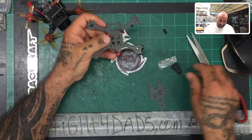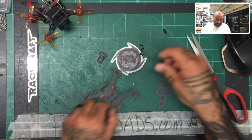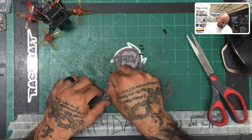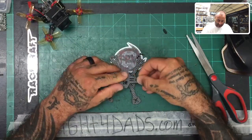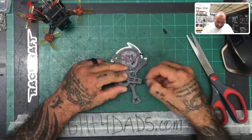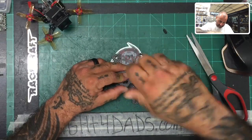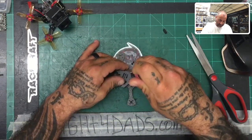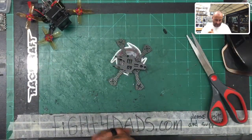Then for the camera plate — it'll be your camera pieces, and they're going to face outward like this, and the other one will go out like this. Go ahead and put our plate on just like that, put the screws in. These are M2 screws, so let me get the screwdriver for that. Alright, there's one, two, and then the last one — and that's it, your frame is fully assembled.